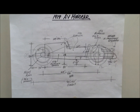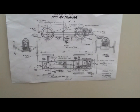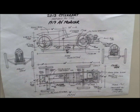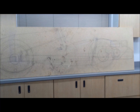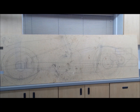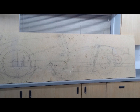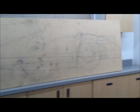This is a one inch to the foot drawing. After I had this drawing done, I refined it with this drawing, giving me a direction to go. There will be some changes along the way. When I was happy with the final drawing, I transferred it to a piece of particle board. Since the drawing is one inch to the foot and a cycle cart is approximately eight feet long, I used a piece of eight foot particle board. So this is a full size drawing of my sketches.